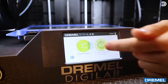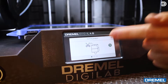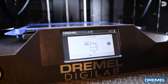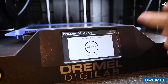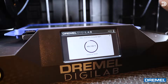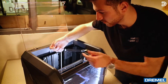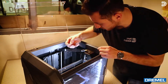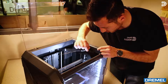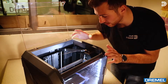Come over to filament, select change filament. If you have filament loaded already it's gonna ask you to cut the filament — we don't, so we'll skip that step. It's now heating up and once it reaches 230 it's gonna begin extruding. Once you can hear the extruder head extruding, pull the filament up, run it through the top piece and then into the head. Hold on for a second and you'll start to feel it pull.